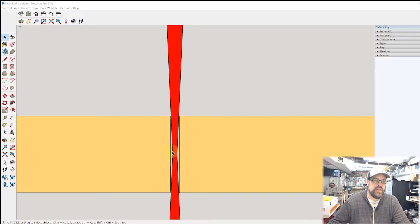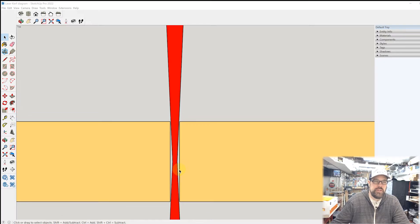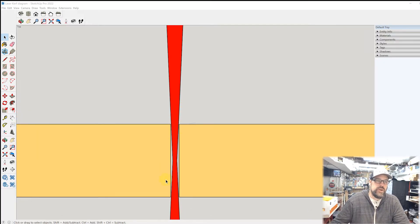While your focus point may be down to 0.08 millimeters, your actual kerf is generally a little bit wider, depending on your material. Different materials will produce different kerf because of how much material gets blasted away. With thicker material you're wider on where the beam enters and exits, and if your focus point is higher it diverges more, giving a wider cut at the bottom. You'll generally never have a perfectly straight 90-degree cut.